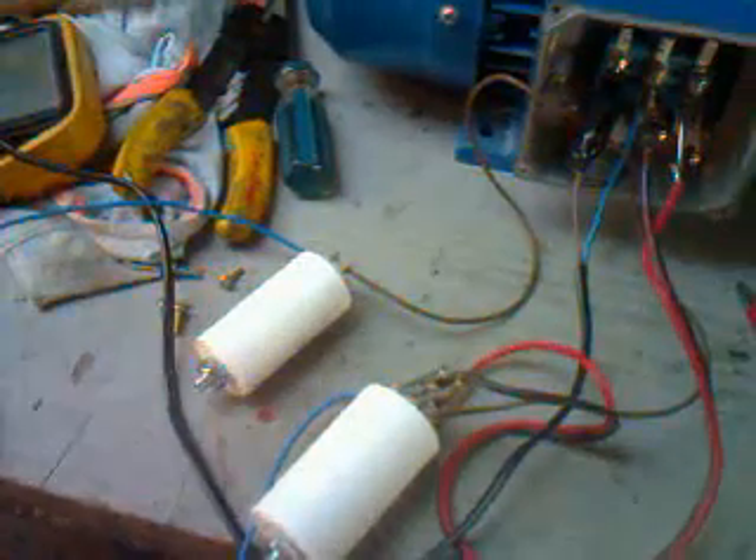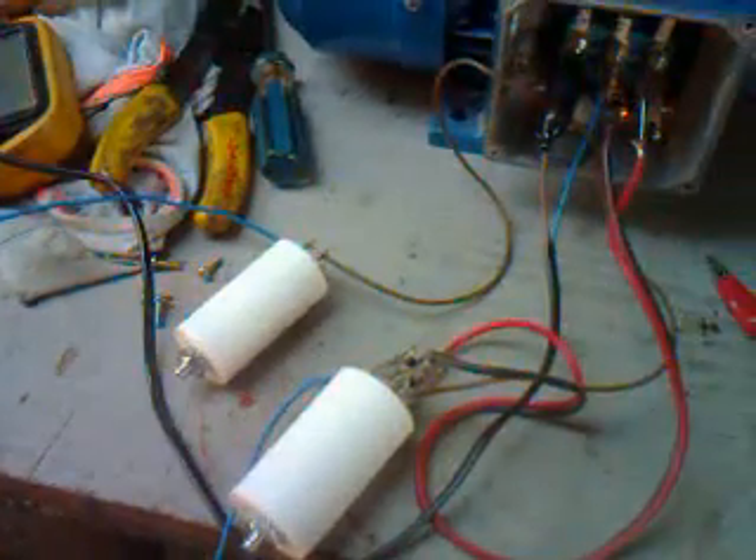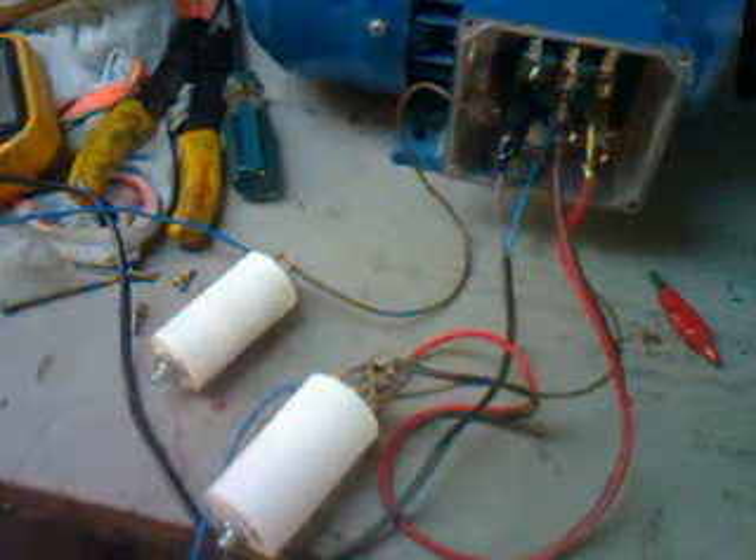So now it works like this and then it spins up. What I currently have is a motor that works. I don't want to run that too long because this wiring is fucking tiny. I think I need more capacitance to start - I think I should probably aim for about 50 microfarads. The guy told me to get 70, but it runs on 30, so that's fine.